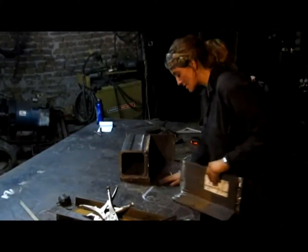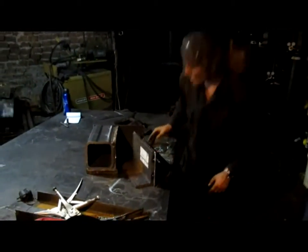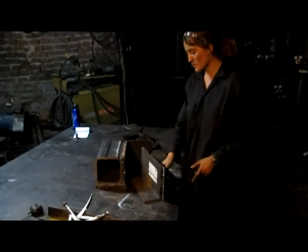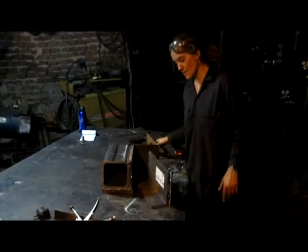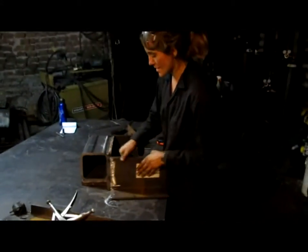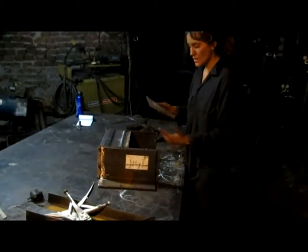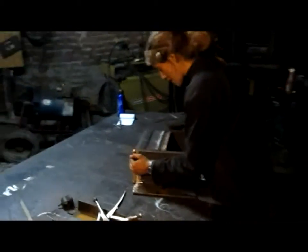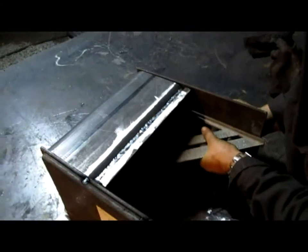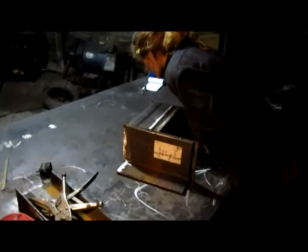So I just need to double check if it's still square. This is to get it square with respect to the table and the drawer — and this is assuming this is a little square. I just ground down any welding bubble. So now I have this piece all ready with the angle over here, so all I've got to do is square it up with this. That's nice and square, and this side too. Double check these edges.